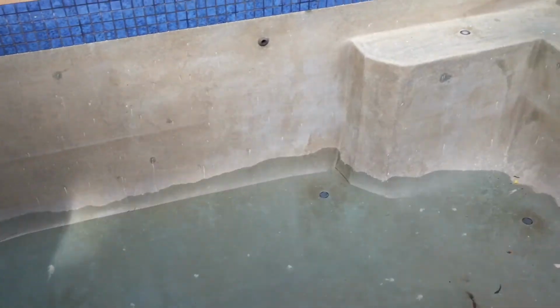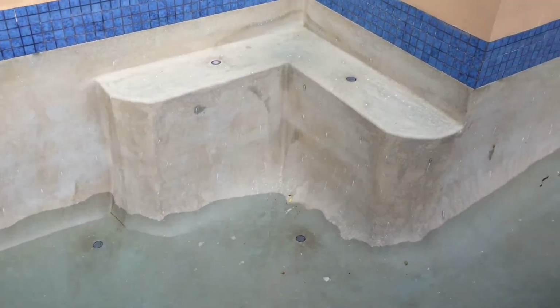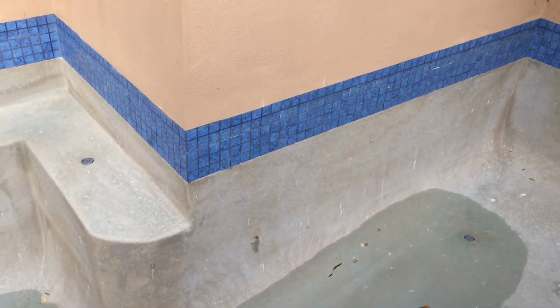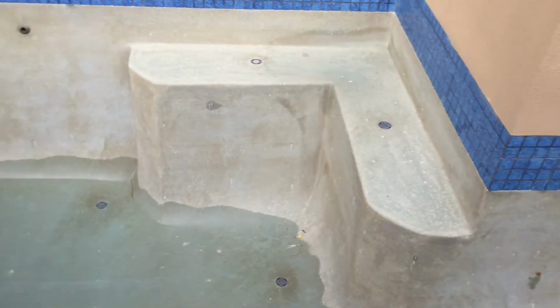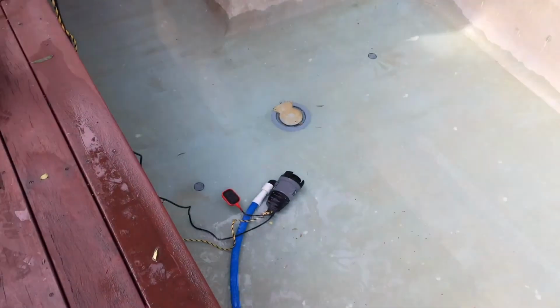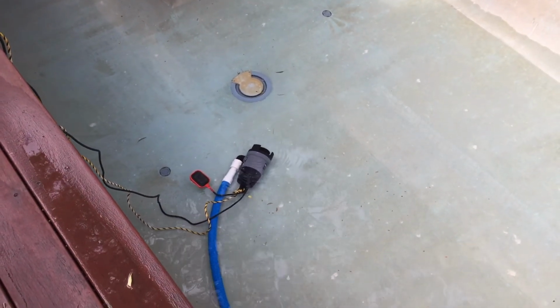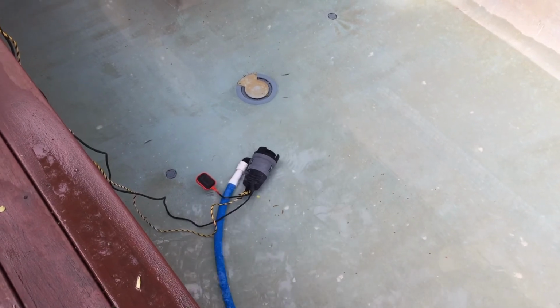This swimming pool you're looking at images of here, I started off exactly what I said, about 4 to 1, 1 part acid, 4 parts of water. I didn't touch it. It was just way too strong. It wasn't moving. Nothing at all was going on until I had it 50-50. And that's very strong and very severe.